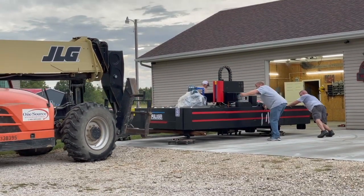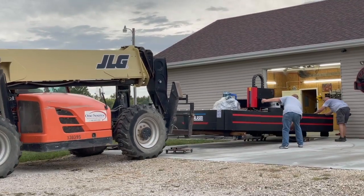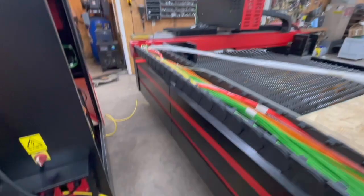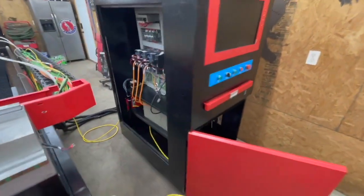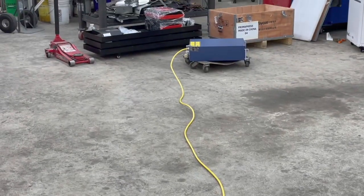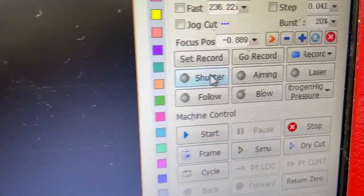After the machine was in place, we got started putting all the wiring together. This is showing you a look right in the middle of — I think we just had mounted the laser head. We ran into a couple of wiring-related issues related to the power source and the chiller. This shop has a three-phase converter. You can see it started to cut that hole there and then didn't finish it, and didn't cut that one at all. We were getting an alarm on the laser source — it was detecting unstable voltages. We elected to move the chiller out onto its own circuit — it's a single phase 220 machine.